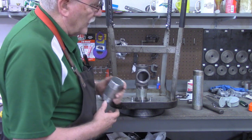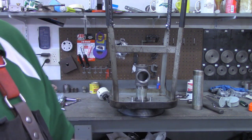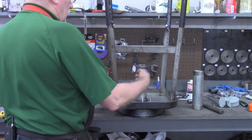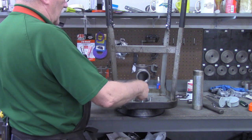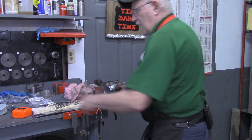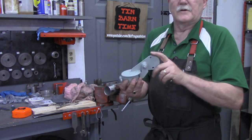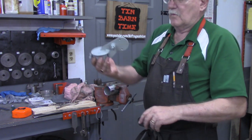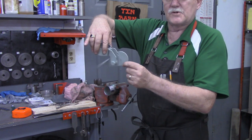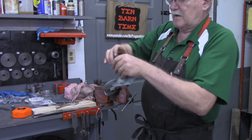So I'm going to swing it around to the vise over here, and I'm going to show you what I'm going to put on the end of this to use as a trap to stop the airflow that's going to come in here. We want to force it down to the coals, or up to the coals when this is turned over. Don't want it coming out our exhaust down here. Just using the vise because I don't have enough hands. But what this is, of course, is a tractor exhaust cover. We're going to be using it upside down. I've put another hole in here, and for the time being, I'm just going to put a weight on there to hold that up. As I look at it and use this some, I'll likely come up with some type of a handle.